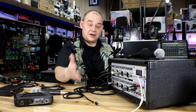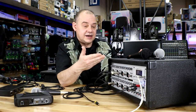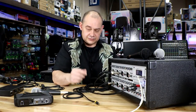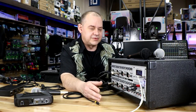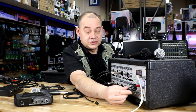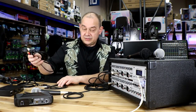This is an amplified mixer, so the outputs in the back are supposed to go to passive speakers — speakers without amplifiers on them. That's why you might use the RCAs: maybe you have amplified speakers, or a friend brings over their powered speakers. You can plug from the RCA output into their amplifier, take advantage of the entire mixer, and it'll come out of those RCAs at the end.